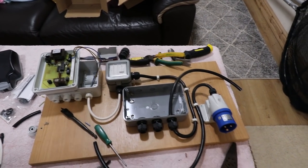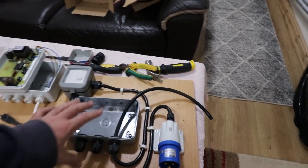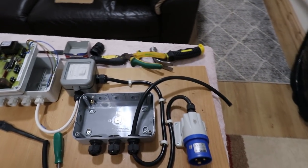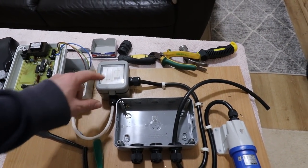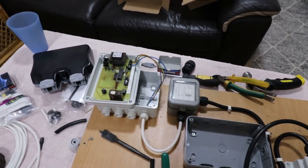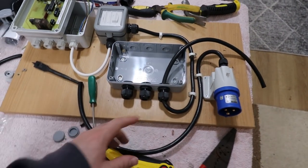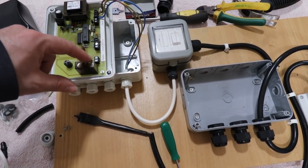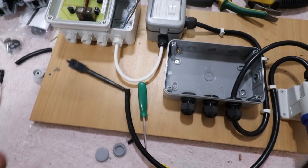I've made a good start - the power comes in here and goes into the switch box. There's enough room in the back of this switch for a few junctions so I don't need a separate junction box. I've put the fuse switch in and it gets its power from here. This little controller only needs a couple of amp fuse because it barely uses any power. I'm going to run a live cable straight into the heating relay and straight out to the heater, like I've done on the fry tank.